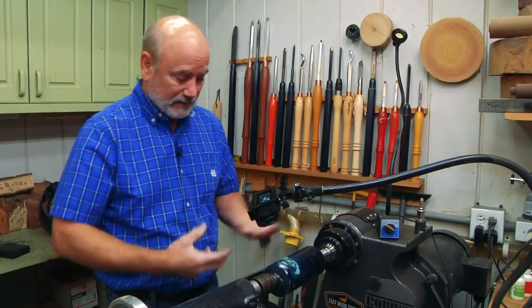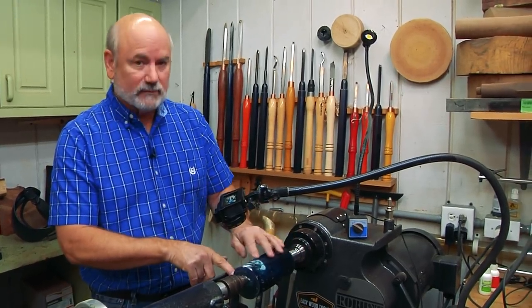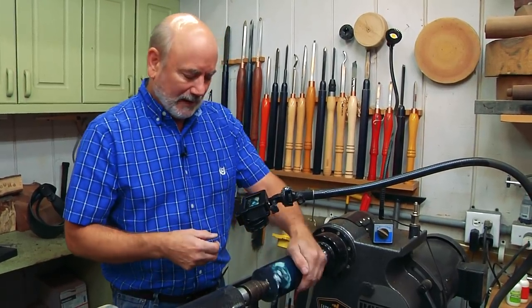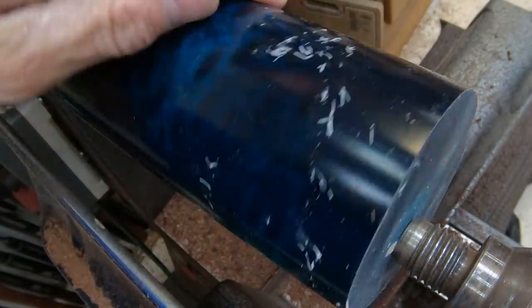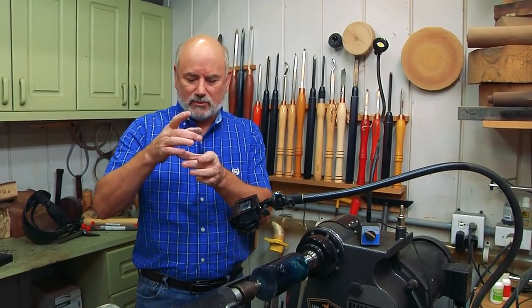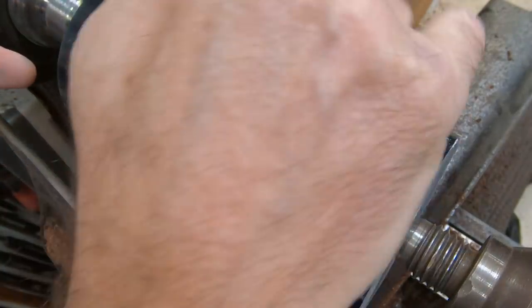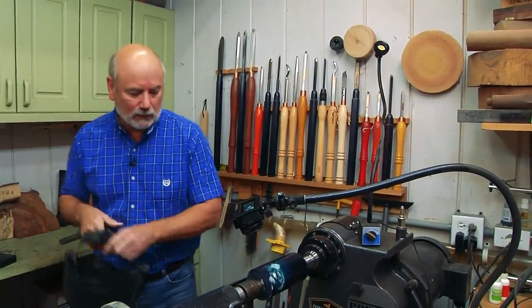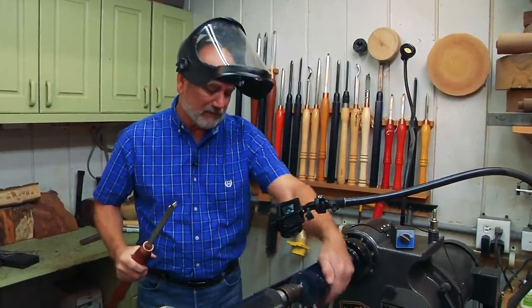I have a blank already made — I took it out of some PVC. It slid right out great, but we can see we have some issues. There are some bubbles in here, and there's another process called vacuum chamber for that. If there's any moisture in something like this, it'll make bubbles. We got some bubbles but we're going to turn that away. The other issue is I didn't build a chamber perfectly fitted to the Banksia pod, so my Banksia pod shifted a bit. My goal is to sneak up and get to the Banksia pod without turning away much of it, staying as centered as possible.